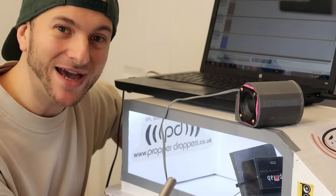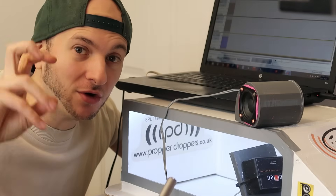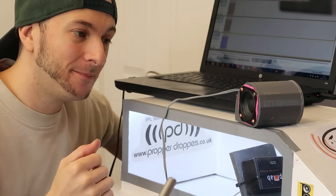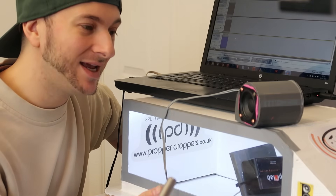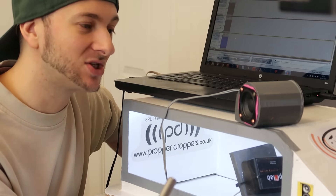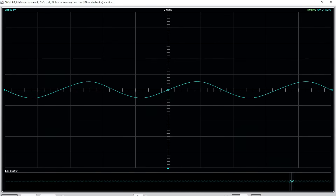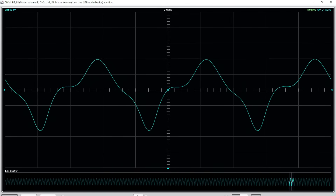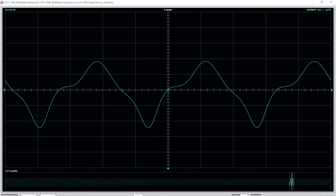There's that lower harmonic. Do you remember what box created the lower harmonic? It was that fifth order thing that wasn't really a fifth order, where the sub was kind of mounted to the start of the port inside the box — that did this as well. So we're clearly overpowering the driver considerably there on power, but it also seems to just be mechanical control — it completely loses it up there. Keeping well within X-Max the sine wave looks okay, it's not super beautiful, but literally as soon as we turn it up and start getting any real excursion approaching mechanical limits, it looks horrendous — just terrible — with this lower frequency on this driver.